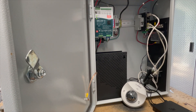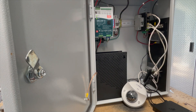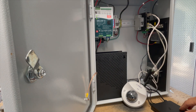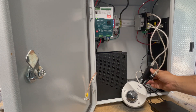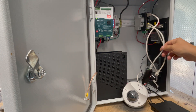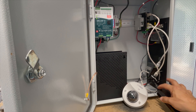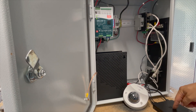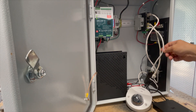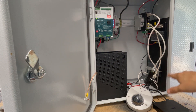This device is ultimately going to be deployed for a remote security camera cloud VMS-style application. We'll be installing a PC from the manufacturer that'll act as our cloud recorder and bridge — I'm just using a small one right now for the example. This PC and the one that will ultimately be installed are using a POE takeoff, or reverse POE device, which plugs into a POE output from the POE switch and provides 12-volt DC on a barrel jack plus a network passthrough. We've got one iPro camera connected to the POE switch and a network cable back to the router.